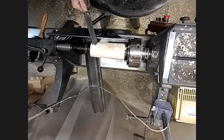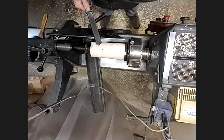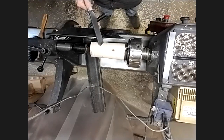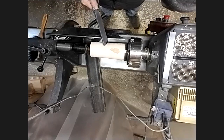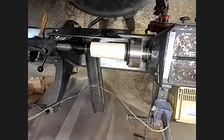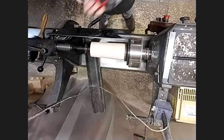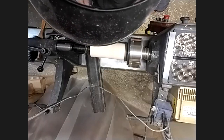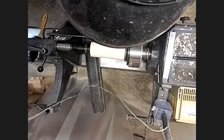Once again, it doesn't matter about speed. You want to see that you're holding your bevel, or you've captured your bevel onto the wood piece, and you're holding it the right way. All you got to do is turn a little bit. You'll see wood shavings coming off. Is that coming through on the video? Yes. Looks good. All right. So, speed her up here. Once again, turning at a speed that is comfortable for me, myself. All I want to do is a nice clean surface on here.